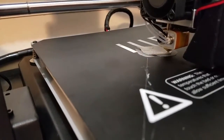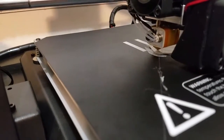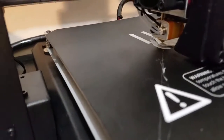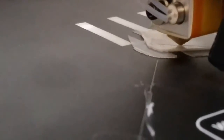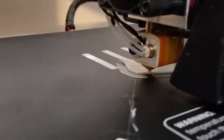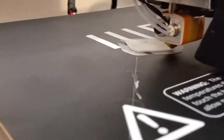And second, if you want to do something metal, you can look up the lost PLA method, which is similar to casting a lost wax method. You make your prototype or your widget or whatever, and then you cast it in plaster of Paris, or in silicone, or sand. Then you burn it on your fire, barbecue, whatever, and you burn all the PLA — which is the filament — out. And then you cast metal in it, so you can actually cast metal things doing the lost PLA method.